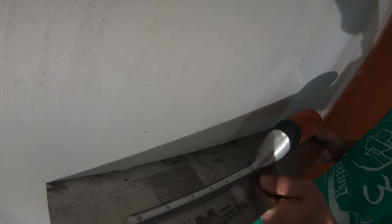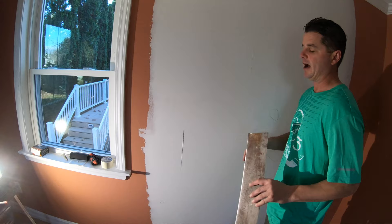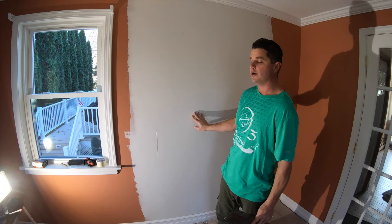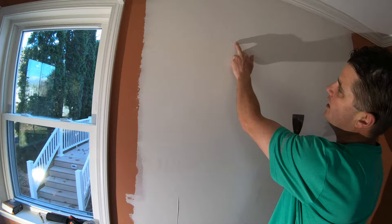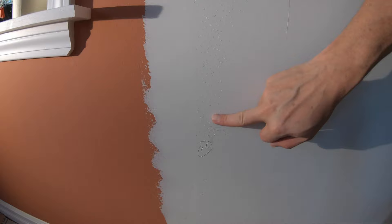To the left and to the right of the hump — that's what you want to do. The trowel doesn't rock back and forth because we added mud on both sides, which took care of that hump. Even after a skim coat you're still going to have some issues. I took a pencil and circled a nick right there, two nicks down here, and some bubbles here.